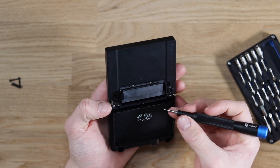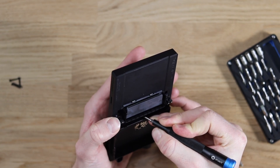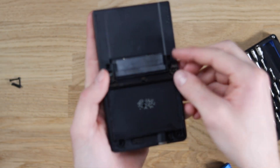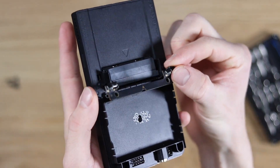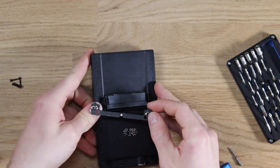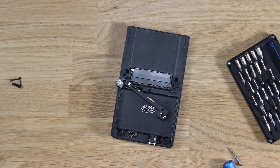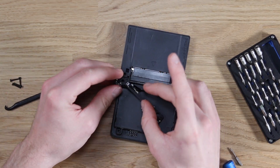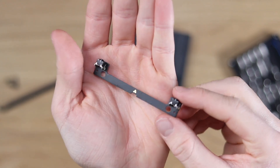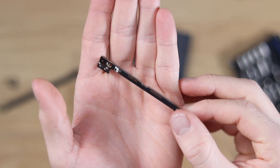I saw someone saying that we were told not to take it apart — as if the inside wasn't finished and we weren't allowed to show it. What I just did there was unhook a small latch holding down the shoulder button daughterboard that you can see here; there's a tiny little latch that clips onto the PCB. Flip it over and there's a small ribbon cable connector — go ahead and unhook that — and here is the small shoulder button piece. If you have a failing shoulder button, that's a piece you'd surely be able to pick up from Analog or even make yourself.